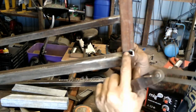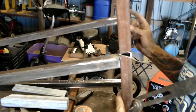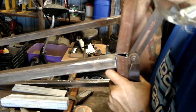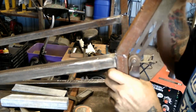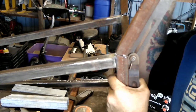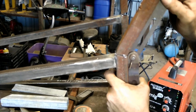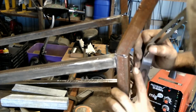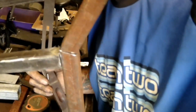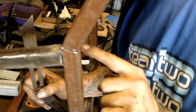Let's bend this down and see what happens. It's cut a bit big, but that's no problem at all. There's 30 degrees, and what do you know - both the edges here line up. They're both at the same point, you haven't got one overhanging the other. So I can just weld that now and we're good. Now one other thing - notice I didn't cut right through. I only cut a V out of it, I left the top edge up here intact, so I can just bend it.